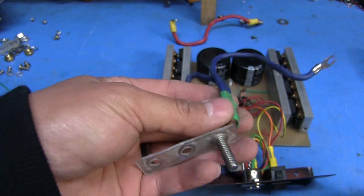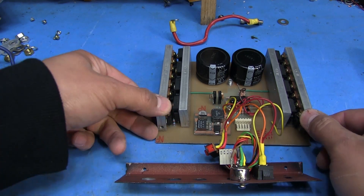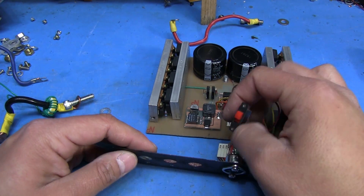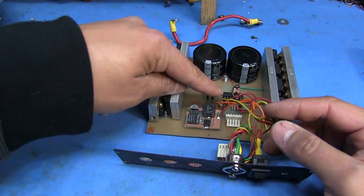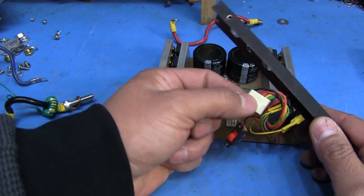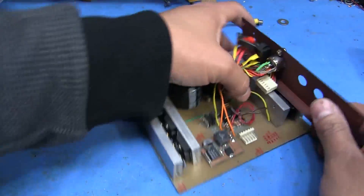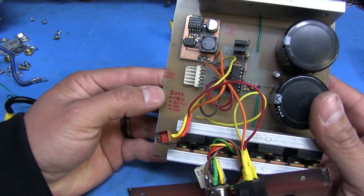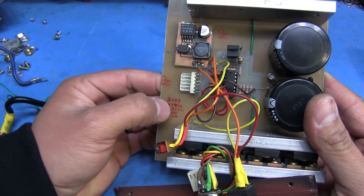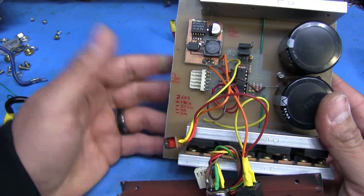This is the positive or the negative going out to the motor. These two aluminum bars were threaded to accept a couple of screws that would hold those in place. This is the voltage selection switch - all this does is change a resistor in one of the sections of the board, as we'll see later on. This is just the port that goes to all the other stuff connected to this connector, and that goes to the board there. As you can see I've got it labeled right here on the board so I wouldn't forget when I was building it. It's just ground, battery voltage in, battery voltage out, five volts out, hall sensor or potentiometer whichever one I want to use, and then the one for the brake.